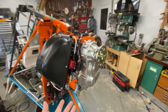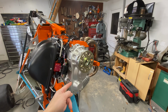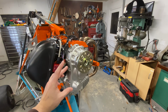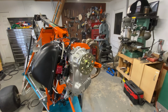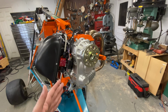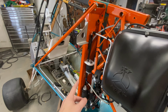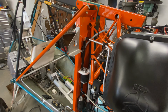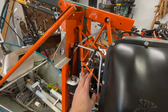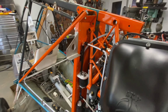The gearbox is mostly in. I have to put some Loctite and drop the gear onto the output shaft and actually close this guy and fill it with fluid. Again, little stuff like that. Underneath here, I do have the radiator off so that I have access to this. That's just a tighten up item and it'll be on there, but our fuel line is done, secured, comes off of here and down.